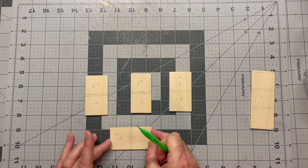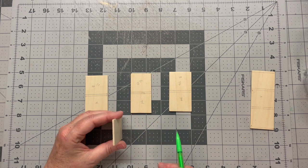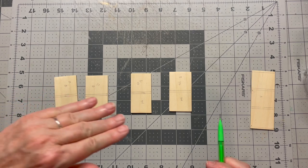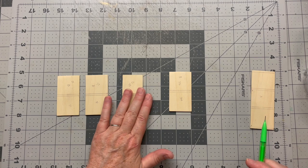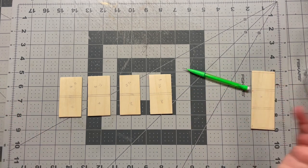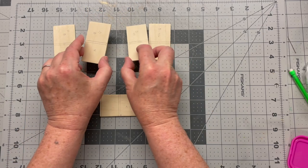The distance for measuring where your shelves are going to be is the same for all four pieces, which is why I've lumped them together. For these four pieces, starting from the left, measure at 33mm and 36mm. That leaves one space that's 33mm and one that's 34mm. It doesn't matter whether the top is 33 or 34, but it does matter that all four are the same, otherwise your shelves will go at an angle. Make sure once you've done those measurements that you've marked them — I've marked 33 and 34 on them. One of your B pieces and your C piece will need measurements on both sides because shelves will come out from both sides of those two pieces.